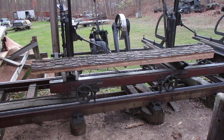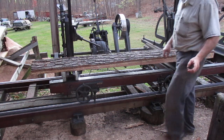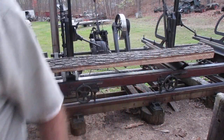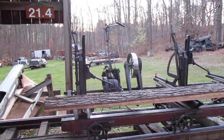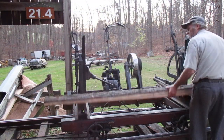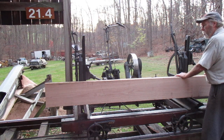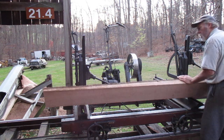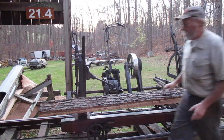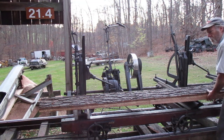This is what I'm showing you for two reasons. A couple people keep asking why you plane the wood, or go down, like if this was in the middle this way, you go down and take a quick slice off of it. Well, you do it because the boards bend and warp so much, so fast, and they have tension in them. This board here was cut, and then by the time I got on there, look. Now the beds are level, but look at the wobble in this. This is how quick they move.